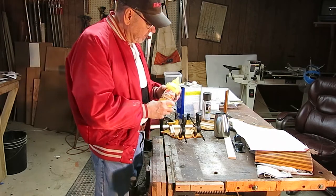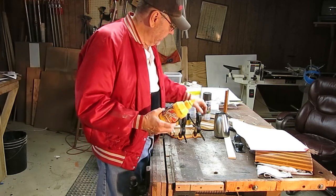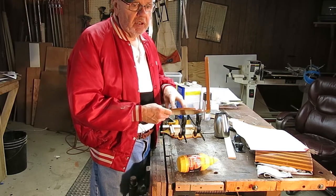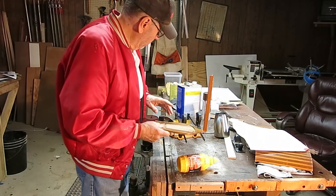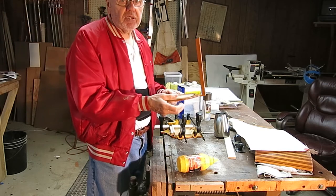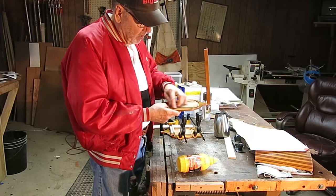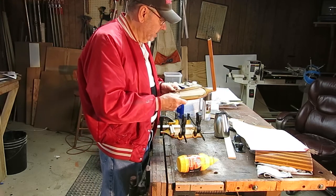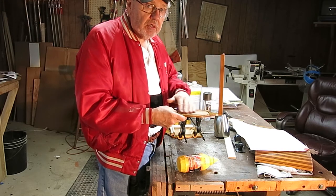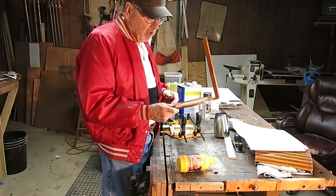Now I know what you're thinking — I said I was going to use hide glue. But that's when I put it back together. When you're mending or fixing something, it's okay to use yellow glue or epoxy or something like that. But for the original glue-up — the way they glued it when they made it — I'll use hide glue just like they did. And before I put the glue on there I'll have to scrape all the surfaces clean and get all the old glue off so they get good adhesion.